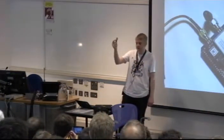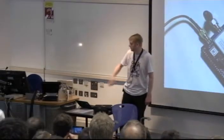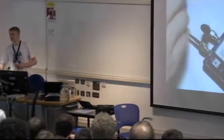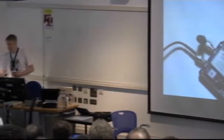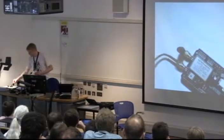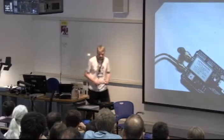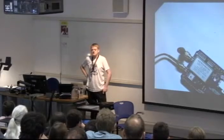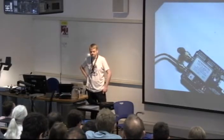You can, if you've got an SMA socket, fit any of these active antennas. They all seem to fit, but you have got to cut the feed down a little bit. I've got a couple of demo boards here, which I just used a scalpel to modify. So if you've got an SMA, you can stick an active antenna directly on the edge like that. I've not done this on the Arduino board, because I know somebody's going to stick one of those silly Chinese cameras against one of these things and jam it out. So if anybody's listening, don't use them near a GPS antenna. They will lock your GPS out. GoPros, not so much. But there you go. Any more questions? Okay.